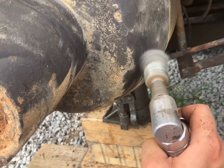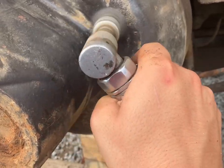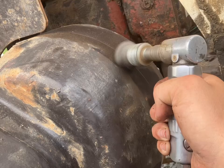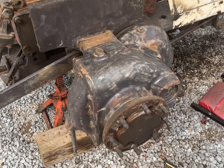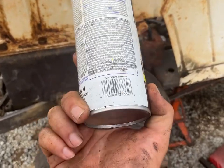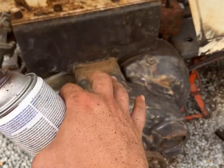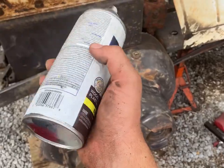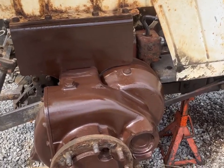Before we get this wheel back on, we can go ahead and paint the hub because it's a lot easier to get to now than after the wheel's been put on. I'm using a wire wheel to bust off the majority of the dirt, then we'll wipe it down with alcohol. Earlier I showed the IH white, but for the body we're using Rust-Oleum satin espresso — it dries almost like a milk chocolate color. I know older David Browns didn't really look that dark, but I really like how this color looks with that IH white.